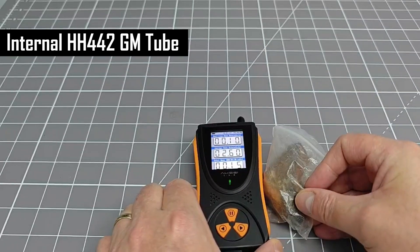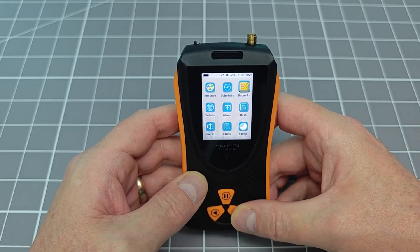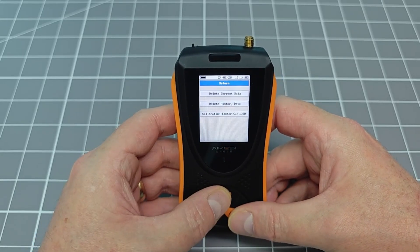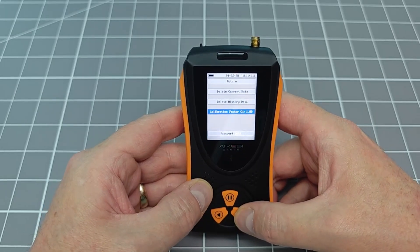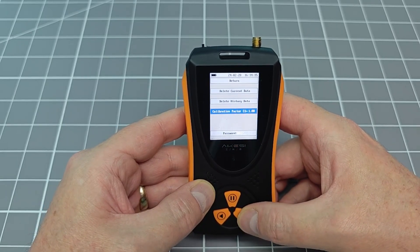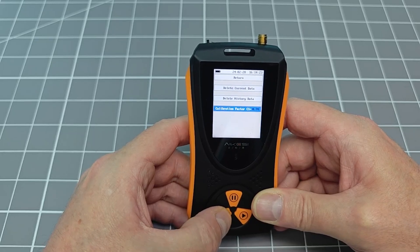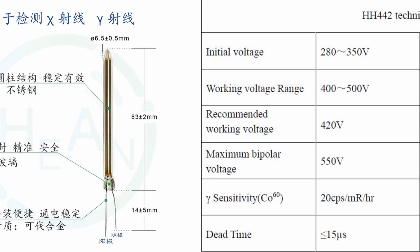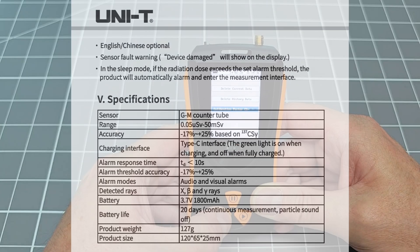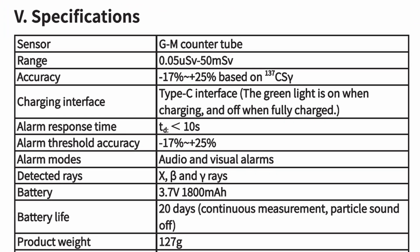One thing is for sure — this upgrade has increased the sensitivity by about a factor of 3. But it needs to be remembered that there appear to be two different calibration coefficients used in the HFS 10. One of the few redeeming features of this product is that the calibration factor can be set within the menu. However, this is only the calibration for dose rates over 1 µSv per hour, meaning that dose rates lower than that — such as for background radiation measurements — will not be able to be calibrated correctly. Another thing I find strange is that the HH442 tube datasheet indicates that the tube is only sensitive to X and gamma rays, and that the stated sensitivity is based upon cobalt-60 gamma emissions. But the product datasheet claims the device is sensitive to beta, X-ray and gamma, and the sensitivity is quoted with respect to cesium-137 gamma emissions.